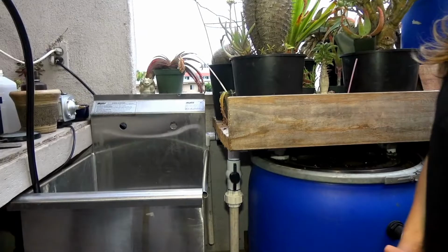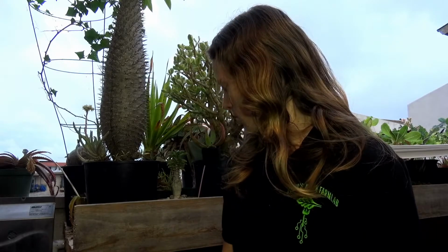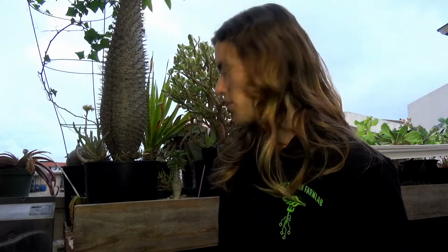We put in about 10 pounds of manure into the tank. So we're going to start out by putting between 10 and 20% of that weight into the digester. In order to start up the reactor correctly, you basically have to feed it little by little. And this will adapt your culture to whatever you're going to be feeding it. And you'll know that your bacterial culture is healthy if the pH of your digester is between 7 and 8. Really, that's your main indicator. So we'll be showing that in another episode. In this one I'm just going to show you how to feed the digester.